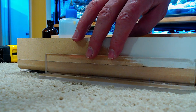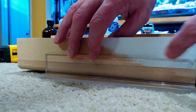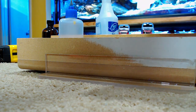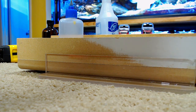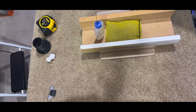If you pull the pins too soon you end up with bubbles — you end up with a dry seam. You want to have enough time for the glue to melt the piece on top and the piece it's going into, because it's welding them into one. Our final product now has the leg on the other side nice and rigid.